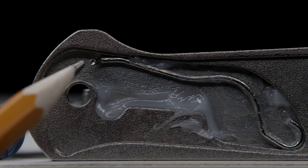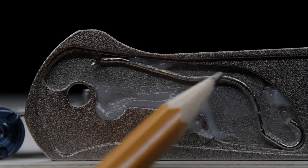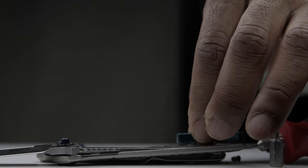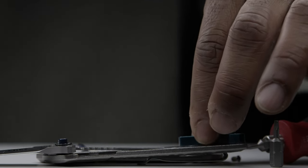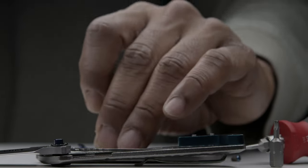With these two bends on the tension bar, I believe once it's reached a certain point, the bend points in the bar relieve the bar's tension but retain the spring forcing the blade going forward, allowing the detent to take over and pull the blade closed. Now of course, this is just my theory from what I'm seeing here.